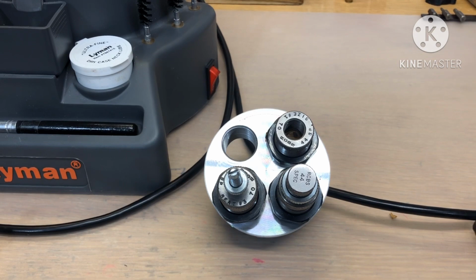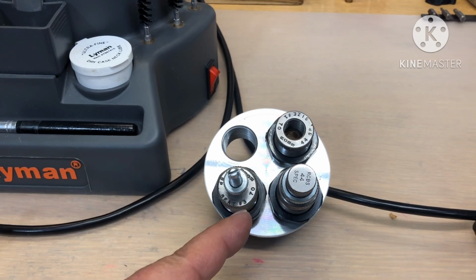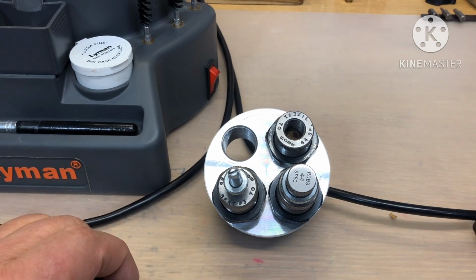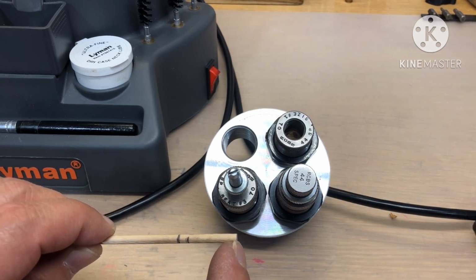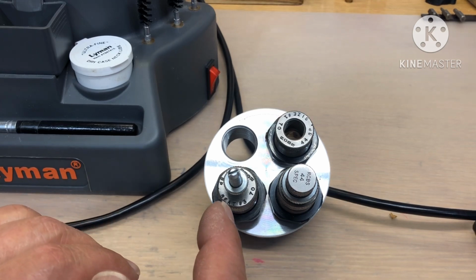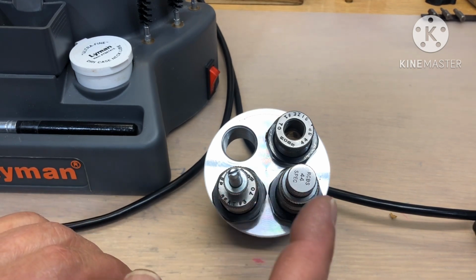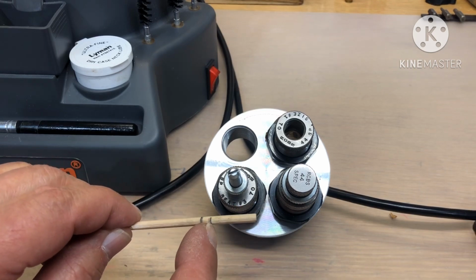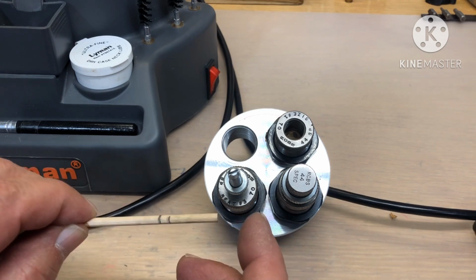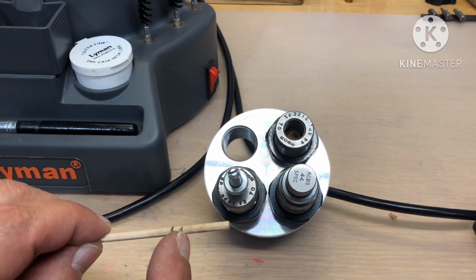Okay, so I ran into a snag crimping the bullet with this old 1970 RCBS 44 special set here. And so I took a stick and measured from where the crimp starts. And what was happening is this bottomed out on the shell holder, and it wouldn't go up far enough to crimp. And I didn't realize that this is longer than my other set in 44 Magnum. So this is this die set, and this measurement, a guesstimation, just feeling it to where it touches that crimp shelf. This is a Lee Factory crimp from my 44 Magnum set. I had to use that. And that's the length on here.